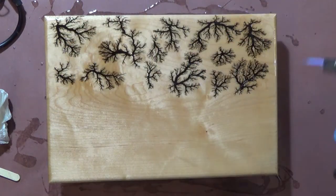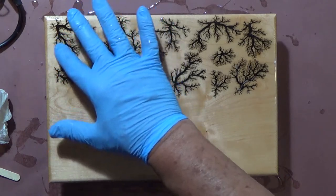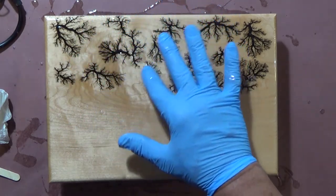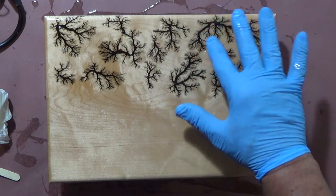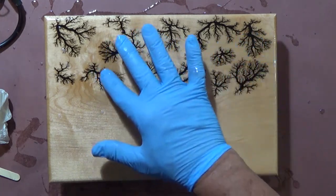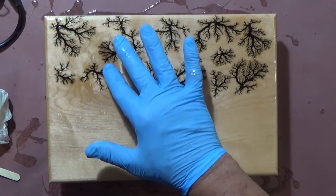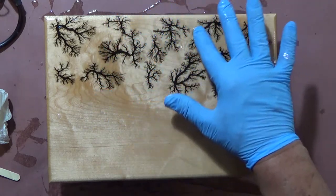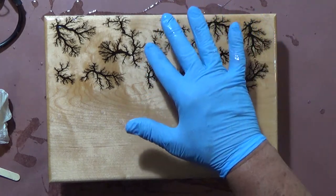Now, the other thing that I did on my experiment too is anywhere these bubbles were, as opposed to torching them, I just essentially came through here with the heat gun for a period of time, especially on these burls where they want to pop up. The stuff is nice and fluid now that I heated it. So I just come back and rub in these burls and it pops the bubbles. I think it pops the bubbles and I think it helps maybe push that epoxy down in those burls a little bit better. Somehow or another, it helped seal them off, because I did this on my experiment piece and it seemed to help quite a bit, especially on the red cedar piece that I was having the most trouble with the bubbles on.